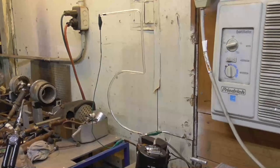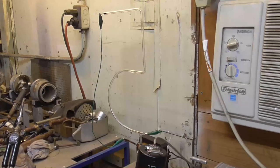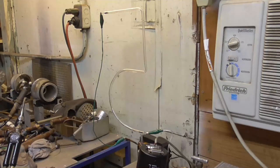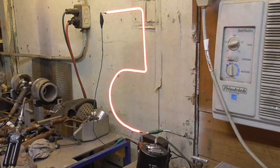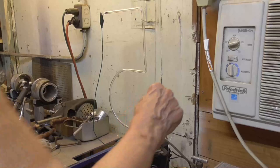All right. We've had it pumping for half an hour at, let's see, 2.5 times 10 to the minus 5th. And when we put neon in it, it's nice and beautiful. We just have to pump it at low vacuum. If we don't go down low, we have that purple glow that takes over. Okay, we're done. Let's go ahead and seal it off.